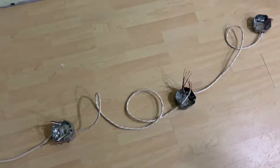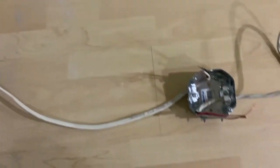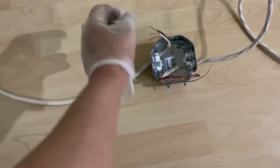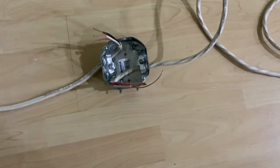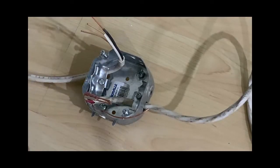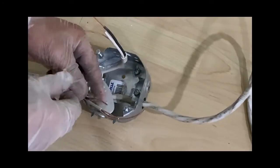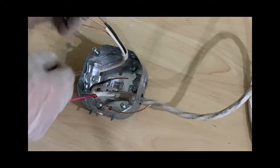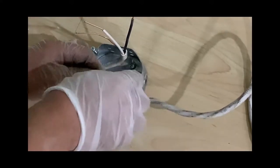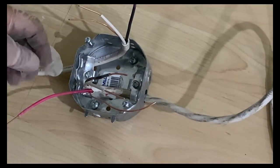This is the actual replica of the three smoke detectors I have connected. This will be your power source that you connect to the circuit breaker, and that will be connected to the wire that powers the three smoke detectors. I'm going to show you how to wire it. The interconnect wire will not be used yet — what you do first is interconnect the power source to this wire. This is how you are going to wire this.